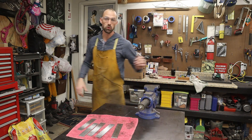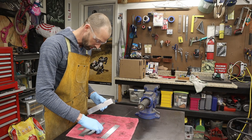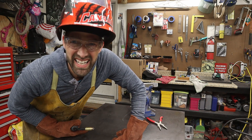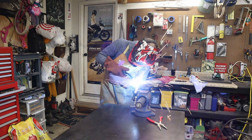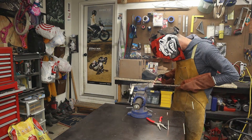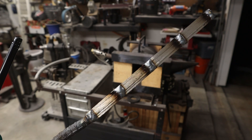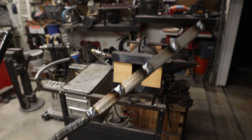Sacrificial vise — a vise that I don't care about, so I weld in that vise. Let's make sure we get our layers right. We wanted the Damascus in the middle, then two thin layers of 1084, and then the thicker layers of 15N20 on the outside. There's the billet — Damascus power core surrounded by two layers of 1084 and two layers of 15N20. Hopefully this turns out to be a wicked new knife. Let's light the forge.